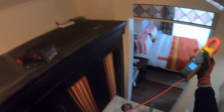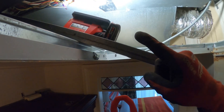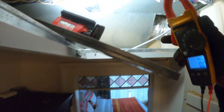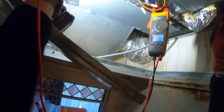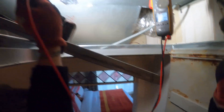But there's a step in between that we didn't actually check. The relay coil got energized, but are the contacts closing? We should have 120 volts on this side — let's make sure we have that. We have it. And if the contacts are actually closing, we should have 120 volts from here to ground. Got nothing.